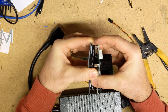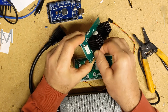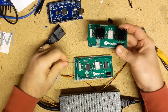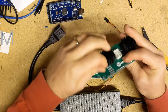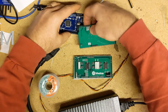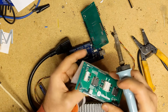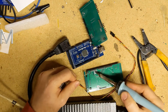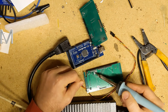Once we get that separated, we'll put those pins in and then flip it over and solder it. The difficulty is getting the pins to stay in when you flip it over. Make sure that we're all ready to go with our solder. We have to figure out a way to keep those pins from falling out when we solder, because the heat sinks are on there and you can't hold them because they'll burn you. So set them on top of something metal — but it's easier to just do the one that doesn't have the heat sinks. Flip that board over, hold the pins in place, then use a soldering iron to heat up the wire at the joint itself, and add a little bit of solder. Then do each pin.